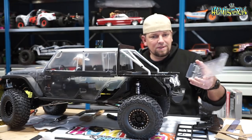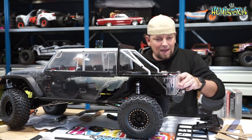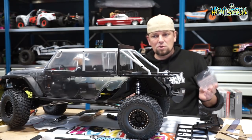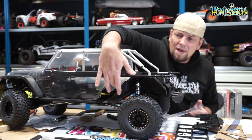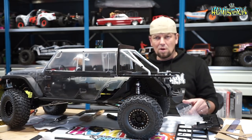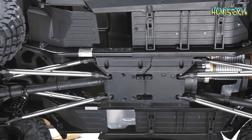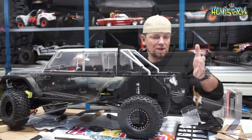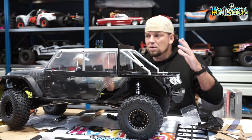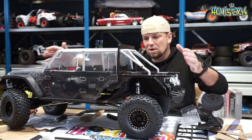In this video we still need to attach this to whatever we made last week and hopefully make this look good. Because currently there is a massive gap sitting right in front of those rear wheels since we have stretched this thing quite a bit. The wheelbase is stretched 72mm and I also pulled the back bumper out another 17mm, so overall we need to add 89mm to this body.